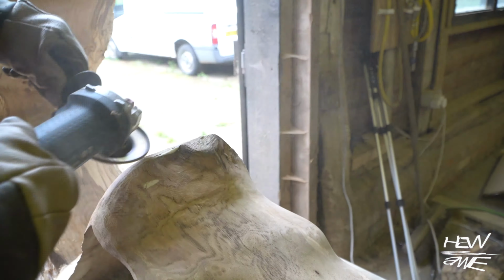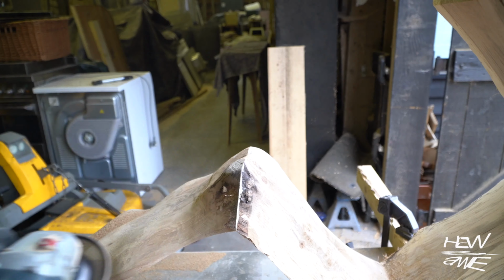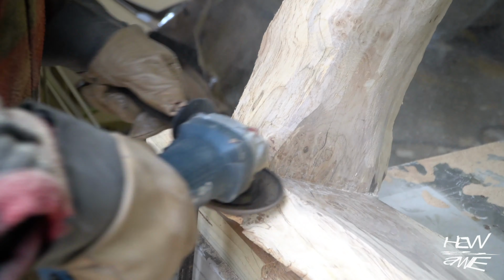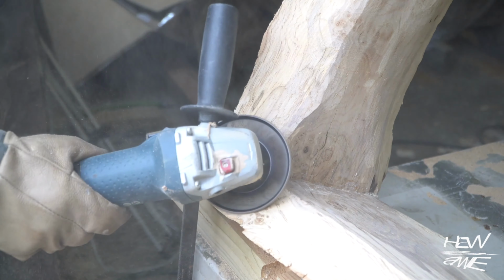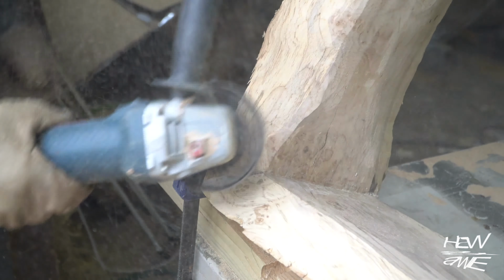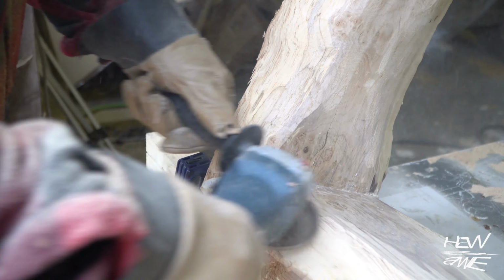It's much easier to glue it up in stages than try and glue that whole thing up in one hit. And I was definitely going to be leaving it for 24 hours before I put any stress on those joints. Make sure everything's absolutely 100% cured. Because as you can see from the finished piece, it looks kind of sketchy, like it's either going to hold a person's weight. Because technically that is mitre joints. Reinforced ones at that, but they hold me.